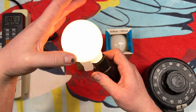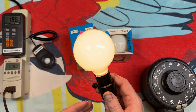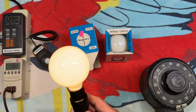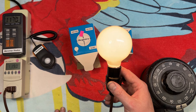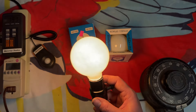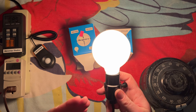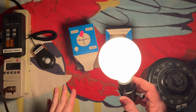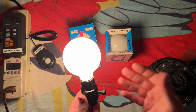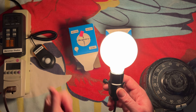It's on. First impressions — it's definitely a little dimmer than 40 watt, but that's to be expected with 130 volt. Right now we're running at 119 volts. So let's turn off our lights here — we got a third one here. And there we go. From these globe bulbs, a very pleasing light. I'd almost say it's 25 watt, but again that's just the 120 volt versus 130 it's rated for.